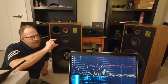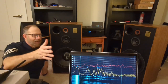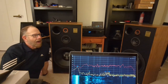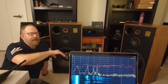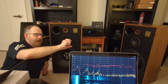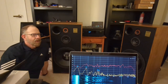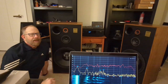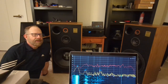Most of it has fallen in an area that's more plus minus 5, which, audiophiles, DIY guys, you'll know. I think in an open environment, untreated room, that's pretty respectable. To have a good portion of it just hugging where my reference line is, negative 80 dB, plus minus 5 dB for the most part. And then there's a few areas where it goes above and beyond. So it's taking up, say, a 20 dB range, and these are broken up into 10 dBs here. Some previous tests I had, they were 20 each, so I fixed that setting.